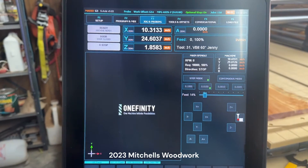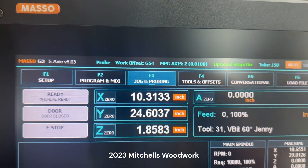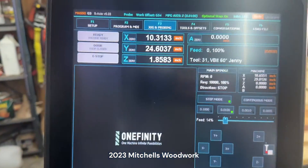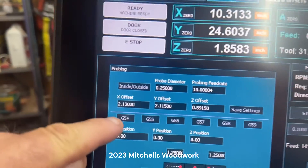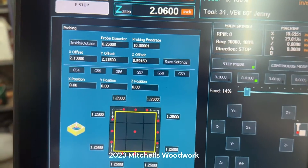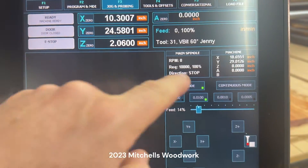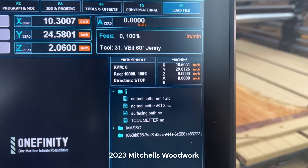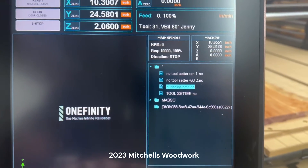All right, we're in the Masso. First thing I want to do is set my G55 so I don't forget. You can see it's set on G54 which is the default — in my case that is the homing position in that front left corner. The quick way I found to do that is go to probing and right here are all the G offsets. I hit G55 and that changed it up there. I can exit because we don't need to probe — I already did that with the paper method. Now I need to load up this file — surfacing path.